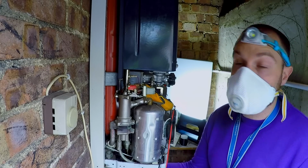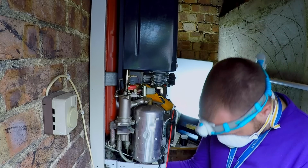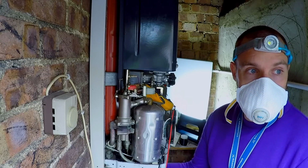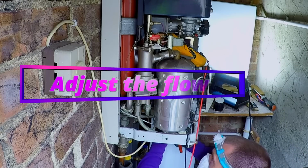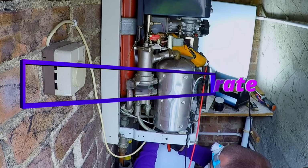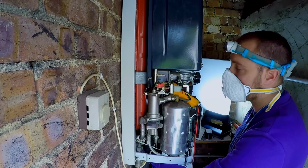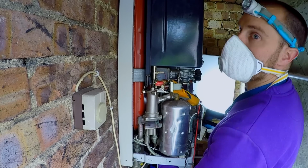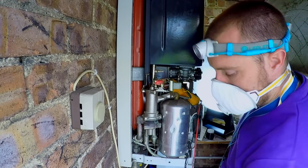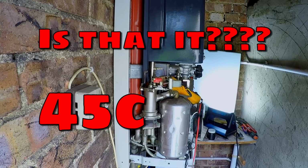Okay, so it could just be gas pressure. Right, because there was a leak maybe from hot water to boiler, wasn't it? Sort of. When you say no heat leaving the boiler, that means water on its own taking all the energy. Yes, exactly. All the energy is going to that. Well, I think you'll find it's coming hotter. Getting a bit hotter. I think, yeah, check it. I think it is coming hotter now. That's nice and hot. Let me check the flow rate on that now. Ooh, that's hot. Yeah, it is running hotter, 45. Go and have a cup of tea, and then I'm going to come back and check the gas pressures.